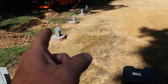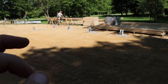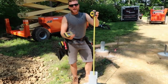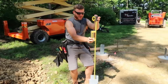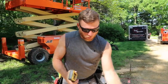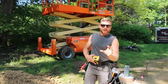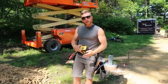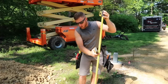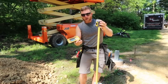We're going to start building on them. Even though we set all these off a laser, I'm going to go back around and get my laser measurement to grade once again on each one of these brackets. I've already found the highest bracket, which when I get my laser mark is 41 and 3/8 inches. My goal was to have these concrete piers about six inches below finished concrete on the inside — this is going to get a concrete floor. In averages, we're really close to 40 inches being my grade, so 40 inches is where I want my actual grade board bottom to be.